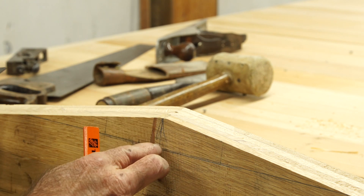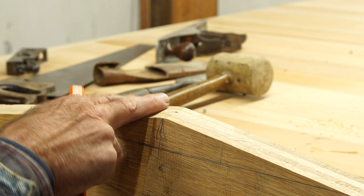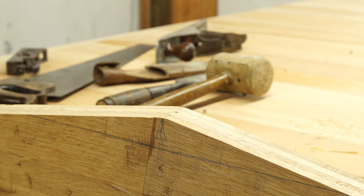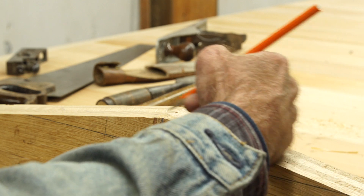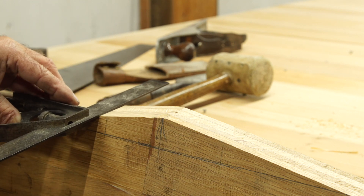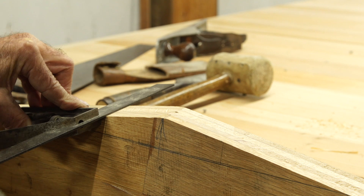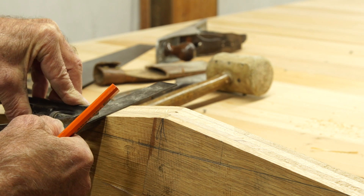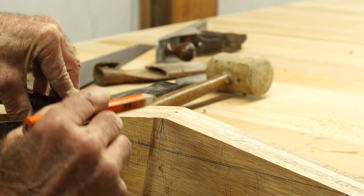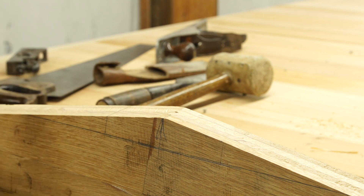It's going to be two inches thick, but three-quarters of an inch of it is going to be sticking up above the transom because the planking is going to come up and butt into it. The next thing I need to do is draw a line on it - I'm going to make a bunch of cuts with a hand saw, then chisel the pieces out and dress it up with a plane. The square has to be held exactly level to get the line parallel to the center line. It's just a little reference line for me to saw alongside.